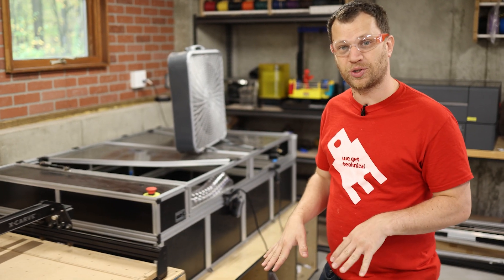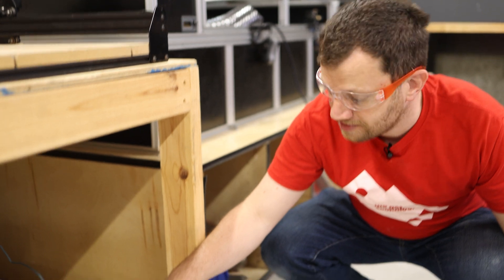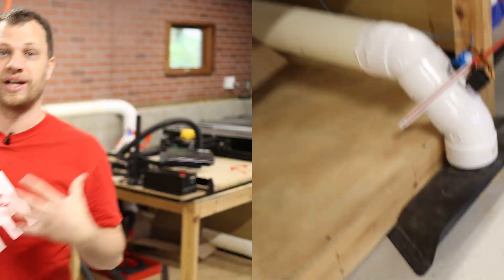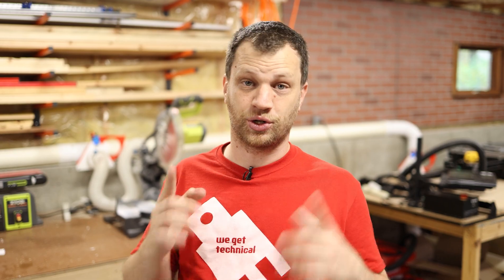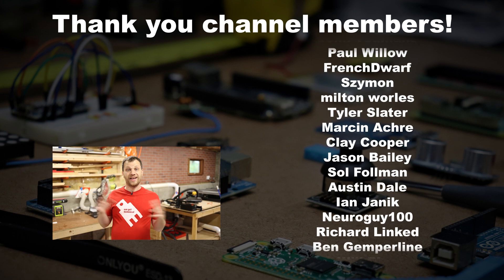Now I'm on to number four — this is the floor sweep. There is no tool to trigger this one automatically, which is why I added a button to each blast gate. The button manually opens and closes each blast gate, which then turns on the dust collector. I'm going to make it interesting by dumping some sawdust on the ground, then push the button to turn on the blast gate and the dust collector — and now I can sweep this up. I'm going to save so much time having this in my shop. It's a game changer. How many times have you gone to use a saw and said 'this is just going to be a quick little cut' and then you're coughing for five minutes because you didn't bother turning on the dust collector? Now everything happens automatically, and I have the peace of mind knowing this system is in place. If you want to build this for your shop, I'm going to have everything available on my GitHub page so you can download the files and build it yourself. If you're into home automation, check out this video where I helped my friend build a device that reminds him to feed his dog.